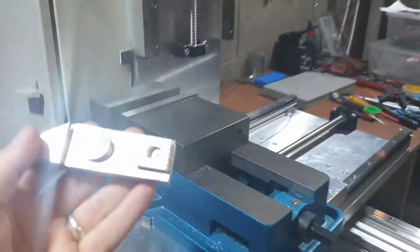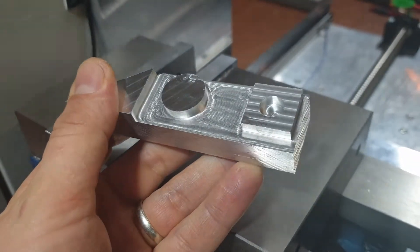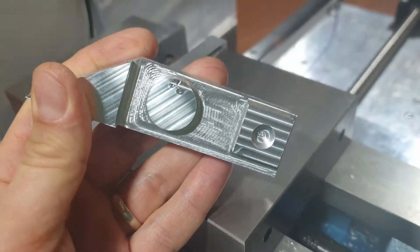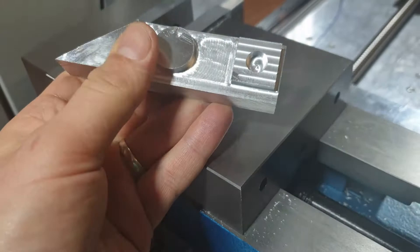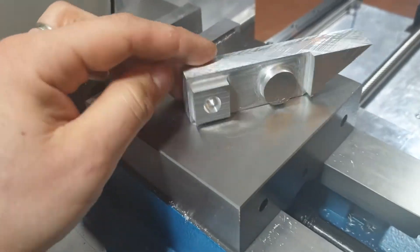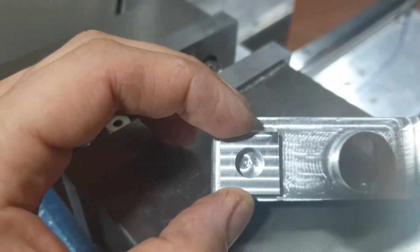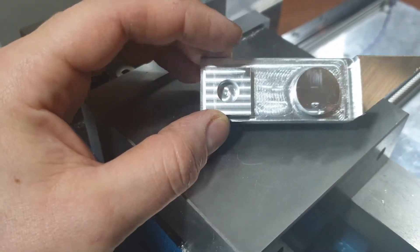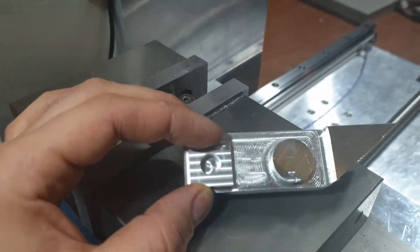This is the first test I did. For the first milling, everything is within size — almost perfectly. I maybe need to tune it a little bit, but this square is 20 by 20 millimeters and it's out of measure by only 100 microns.